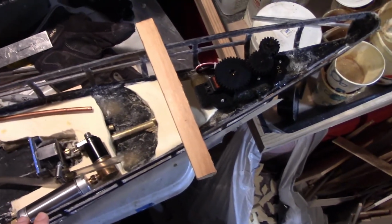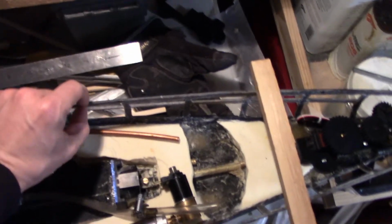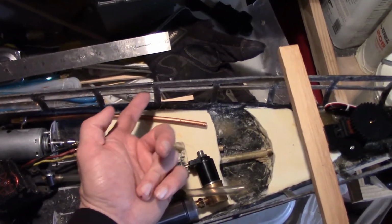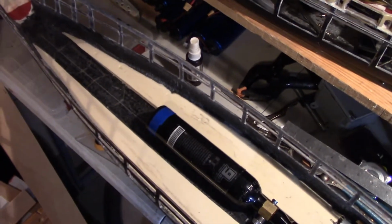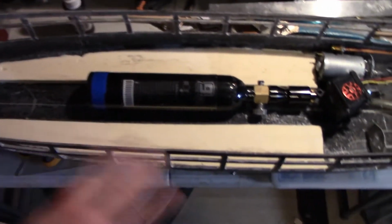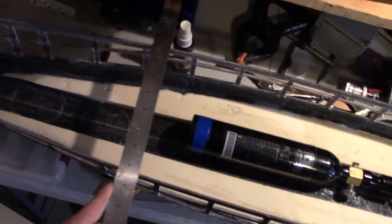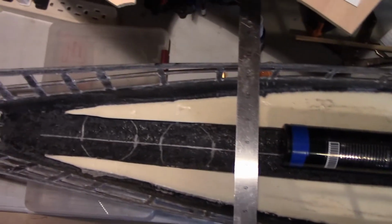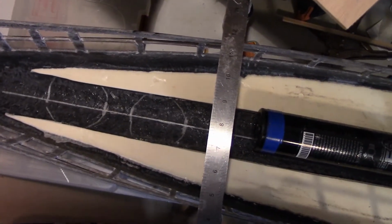And then because I'm going to use the fiberglass, I'll do a 1/4 inch thick at the top and then 3/16 underneath, taper it at the edge so it doesn't violate the rules. And then the rest of the boat, I'll just do the standard deck, so 1/4 inch subdeck, 1/8 inch deck, because this long middle portion will just be superstructure. And then the forward cross member, I'll put right about here, maybe a little bit further forward, so you can see where the turrets are, so you don't want to put it right where the turrets are.